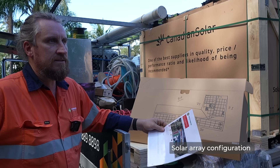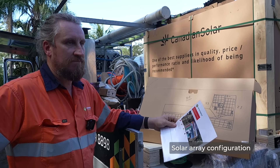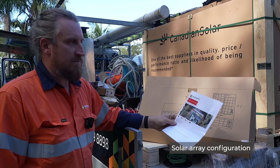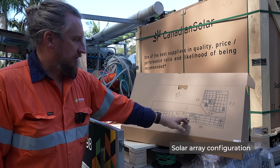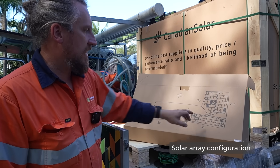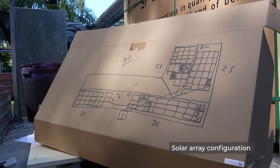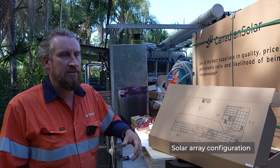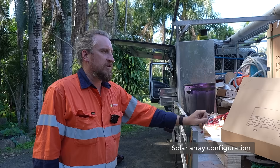It's a little bit more challenging for the wiring, not as easy, but nothing we don't encounter. We'll redo the map so it's a bit more accurate once we get back to site and bring the new one out tomorrow. Up here it'll be a single string with links between two sections — two different strings, 20 panels each — and then another twin over here with a link that's going to be 23 panels each. We should have a limited number of penetrations, which we try to achieve every time — so less chance of water ingress to the roof. I think we're going to have a total of six penetrations.